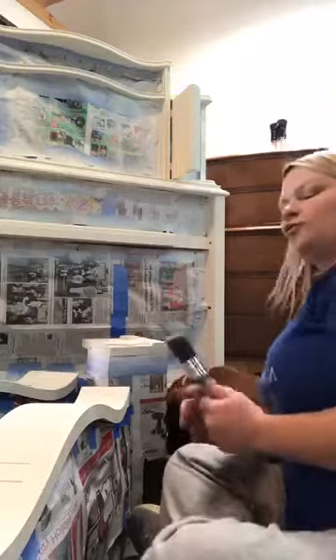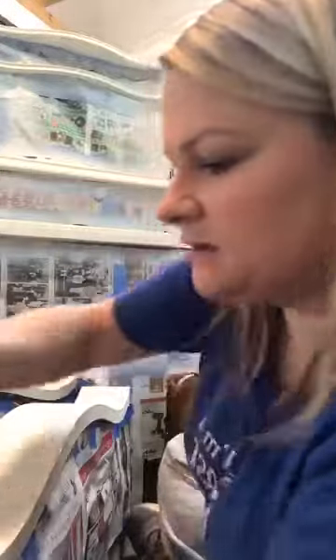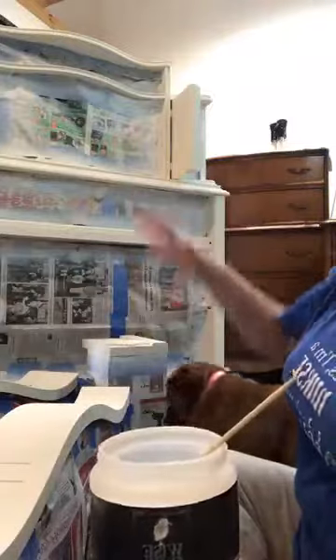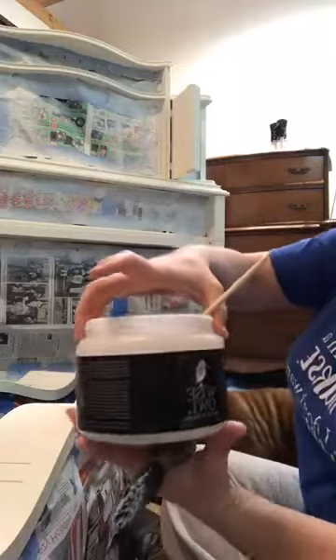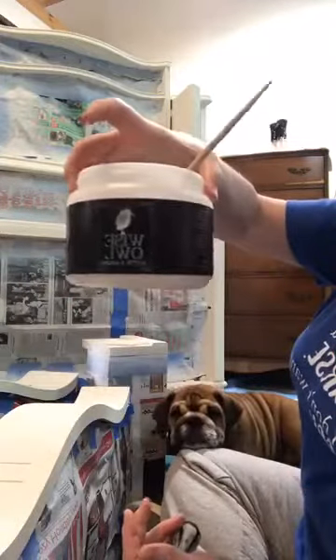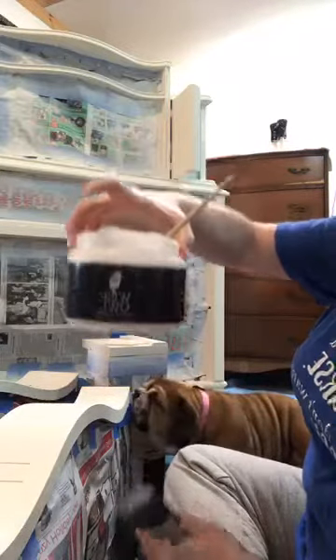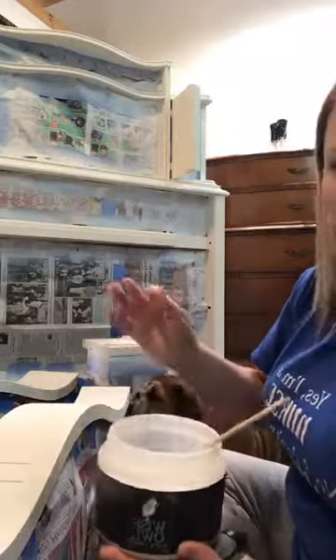It's not cream, not yellow at all — a really pretty neutral white. We are sealing this piece, which was primed with two coats of paint on it. When we do glazes, we always seal after we put our paint on because chalk paint is very porous in nature, and it will grab your glaze and give you a little bit less control.